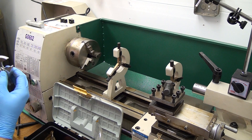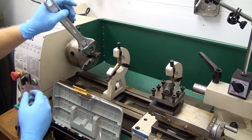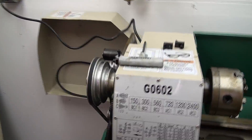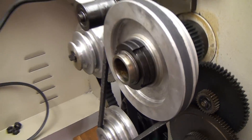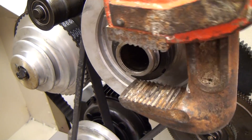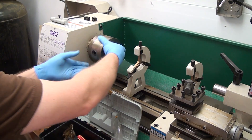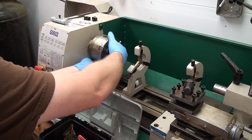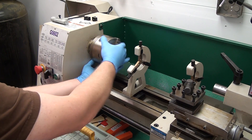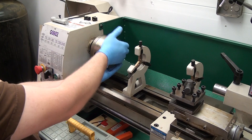If you're not able to use the two chuck key method, get an adjustable wrench and you can insert this on the jaw. This is the way Crevice Reamer did it, and if you hang out on CNC Zone you can probably find his write-up. The pipe wrench on these two rear spanner nuts is where you'll work from the back side — make sure you don't use your pipe wrench on the pulley or on the chuck. But those two spanner nuts, if they get a couple little nicks in them from your pipe wrench, it's not a big deal.